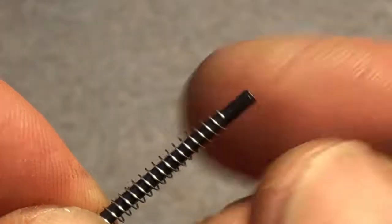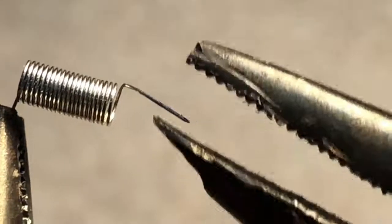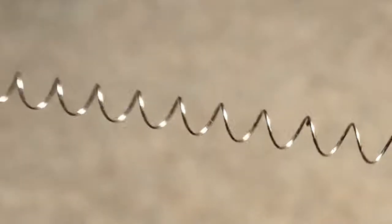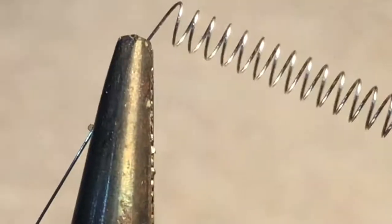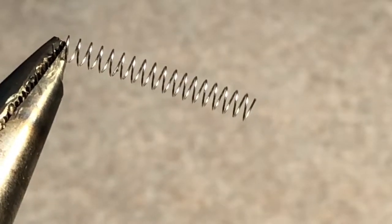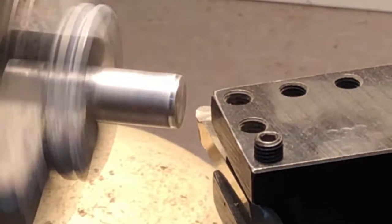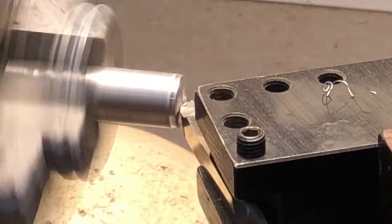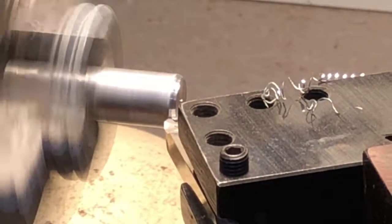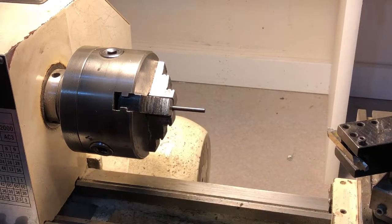So let's make a compression spring. To do that, I use the same winding technique as before. After the spring is wound, I carefully stretch it out. Too much stretching will ruin the spring — just the right amount makes a good compression spring. Once it's stretched out, I carefully trim off the ends. Another method for winding springs is on the lathe. Lathes are normally used for turning metal, but they're also really handy for winding springs, especially if your spring wire is too large a diameter to work with the hand drill method.